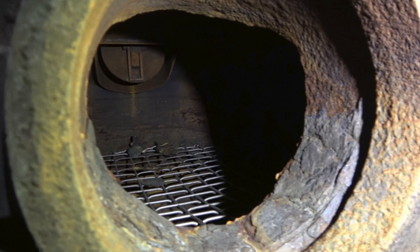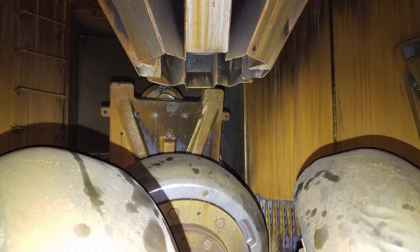When you do that you have to shut the other valve because there's pretty hot air inside those things. This is inside — this is where the reject coal returns down to the grinding table. The coal comes in at the center; new coal is dropping in. On top there are classifiers — little vanes that determine the fineness of the coal leaving.